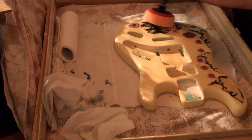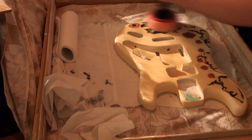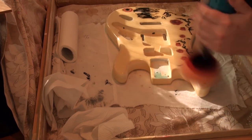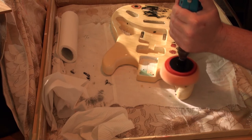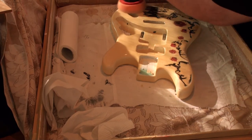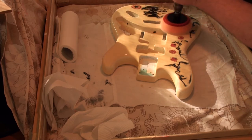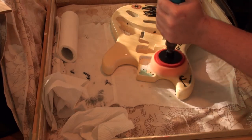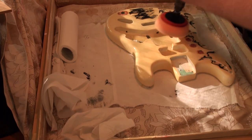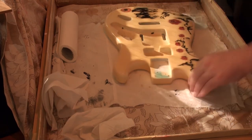You may have noticed this rectangular fence around the area where I am buffing. Well, if you didn't, I'm bringing it to your attention now. It is there to catch the splatter of liquid compound that flies off the buffing pad in all directions. If you don't have one of these, the room will become contaminated with random droplets that could get quite messy. The splatter that you see on the inside of the fence is the build-up of 5 different buffing sessions prior.